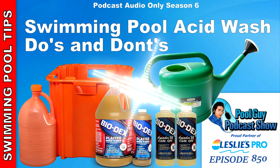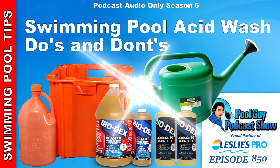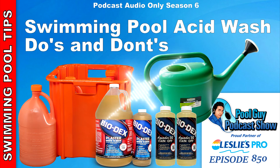This doesn't happen all the time, but you may run into it. Now if you're acid washing a Pebble Tec pool and you notice there's a lot of calcium — you'll see this even before you drain the pool, especially with a darker Pebble Tec pool as white blotches all over — a power sanding of a Pebble Tec pool is not really effective because of the pebbles. You're not going to be able to get the calcium into the cracks there. So the best way to get the calcium off a Pebble Tec pool is to bead blast the entire pool surface.